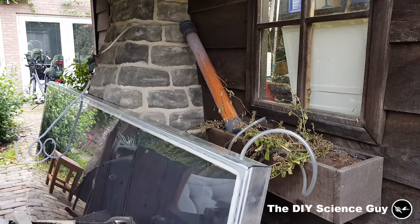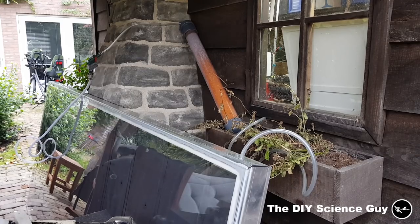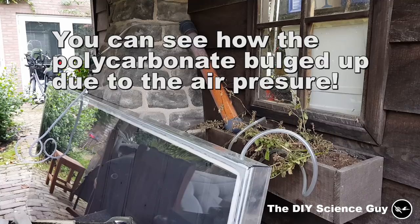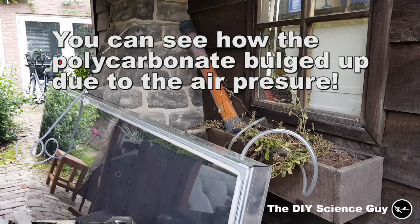I filled the compressor up with 50 liters of air at 10 bar, and I completely let that flow through the panel so that the amount of moisture in the air inside the solar panel is much less, and therefore the air can contain less energy, and that way it loses less energy through convection inside the housing.